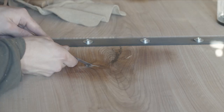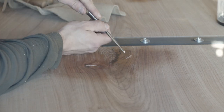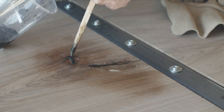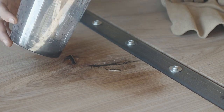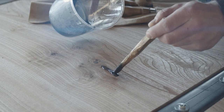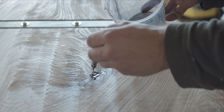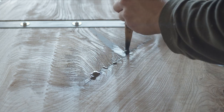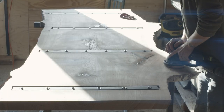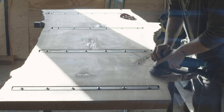After having removed the cup and twist on the flattener we do expose some cracks and defects that the initial epoxy pour didn't reach. At this stage we can do some small touch-ups, and I put lacquer around the area where I'm applying epoxy, because this elm was prone to staining and the lacquer worked great to prevent any epoxy spills from leaving ugly stains in the wood. I used a fast setting epoxy, let it fully cure which takes about a day, then begin rough sanding to remove the excess epoxy and the cutter marks left by the flattener.